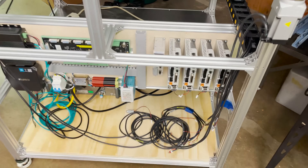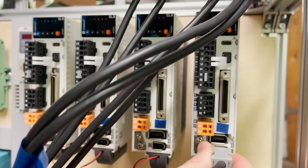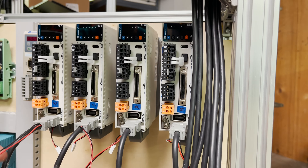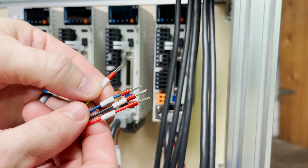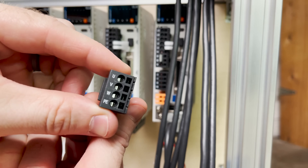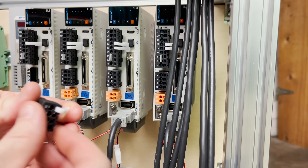Now we just need to start hooking them up to the drives. I've put labels on all my drives so there's no confusion when I'm programming them, and I've also put labels on my Y motors. Connecting all the encoders is easy — they plug right into the CN2 slot. I referred to the manual and it looks like we simply plug the battery cables in here for the absolute encoder. Now to hook up the power to each drive: all the wires are clearly labeled PE, U, V, W, going into these connectors, and you use the little tools they come with to open up the terminal while you plug it in.